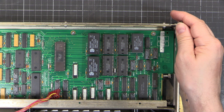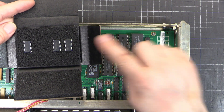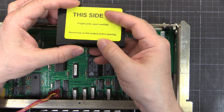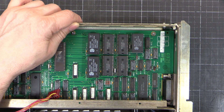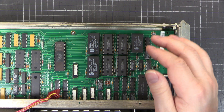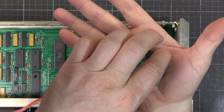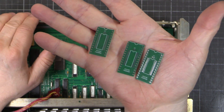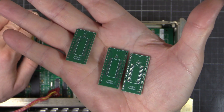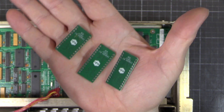The FRAMs I have are right here. This one is going to go here, and these two are going to go here - they're a direct replacement once you have an adapter board. These FRAMs you used to be able to get in DIP chips and they'd literally just plug in if you had the same pin count, but they don't make them like that anymore - only in SMD. So I made some adapter boards. I'll have two of the big ones and one of the small one - links to these files will be down below. You can get them made at PCBWay, who made them for me. Special thanks to PCBWay, the main sponsor of this channel. They come out really nice.